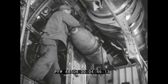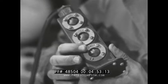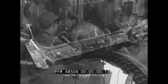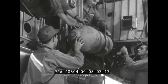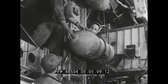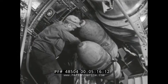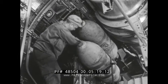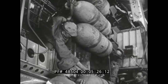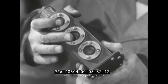As the bomb reaches a point slightly above its loading station, the shackle is positioned. Next, the switch man lowers the bomb slightly and the shackle becomes engaged in the hooks and the bomb is secure. The second 500-pound bomb is loaded exactly the same way. The A-2 sling is easily disconnected once it is relieved of the weight. The third bomb and the fourth are loaded the same way as the other two, and if any bomb shackle doesn't align properly with the hooks, the switch man can roll it into position.